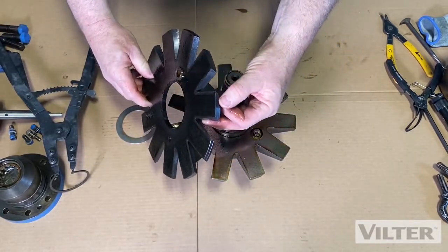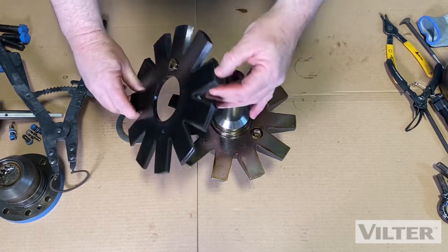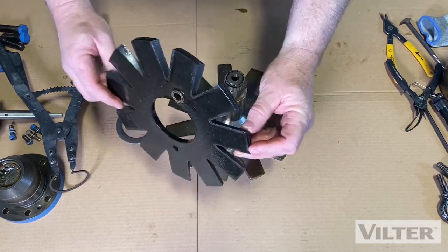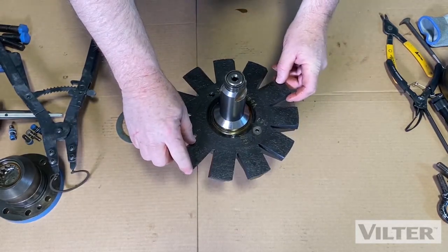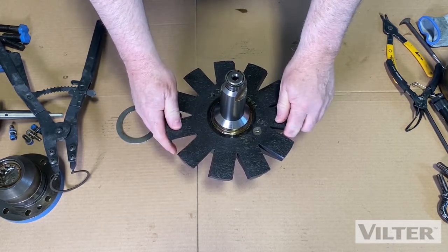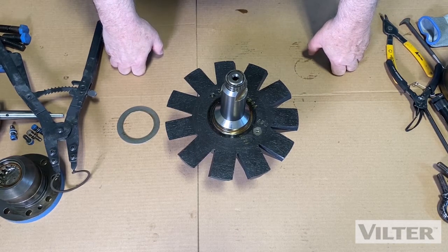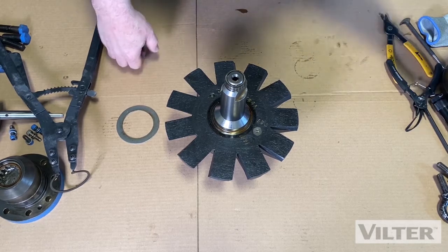You can see the ridges on the end of the blade that I was talking about before, and you can see they're not touching at the center of the rotor — so this blade is in really good shape. These blades do wear but they're not typically a replaceable item because a lot of them will last the life of the machine. You can go 120,000 hours; some may be less if the blades are wearing quickly — that's probably other issues, probably liquid entering the compressor.